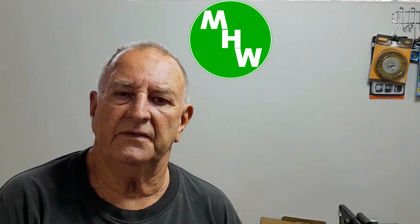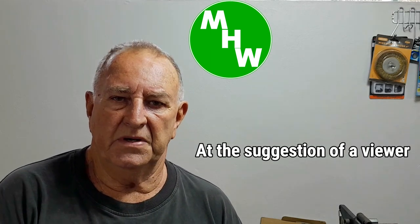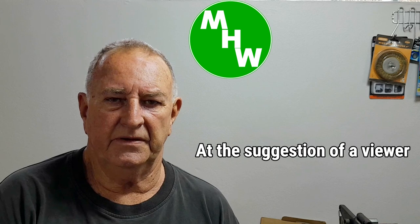What I'm going to do in this video — and maybe the next one or two after that — is document how I get myself out of this, or how to reduce the noise that emanates from this place. What I'm going to start on in this video is the lathe. I'm pretty sure it makes more noise now when it's just running — not cutting — than it did when I first built it. The motor was second-hand and I didn't replace the bearings, so that's what I'm going to do: replace the bearings.